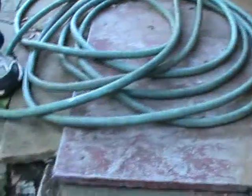Oh, yeah. So this fire escape is not properly sitting and not transferring its load. Most likely the only thing holding the whole thing up is that clip. Diamond plate is notorious for doing this. It's letting the water get between the angle, the C channel, and the diamond plate, and it just rots like that. So it's eating the diamond plate, and it's also eating the C channel lip now. So lots of issues. Look at the one on the front here. Look how bad that is.